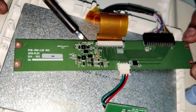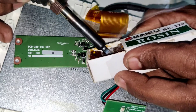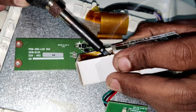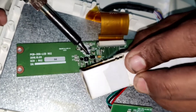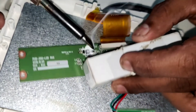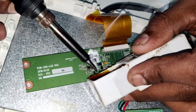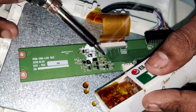This is the indicator, so we have to apply it here. If you have a rosin atomizer, you can use it — I don't have one, so I'm using a soldering iron. Nice and steady — you should not touch the components. You should apply only the smoke key thing on that component. You can use rosin for finding shorts and for voltage injection.